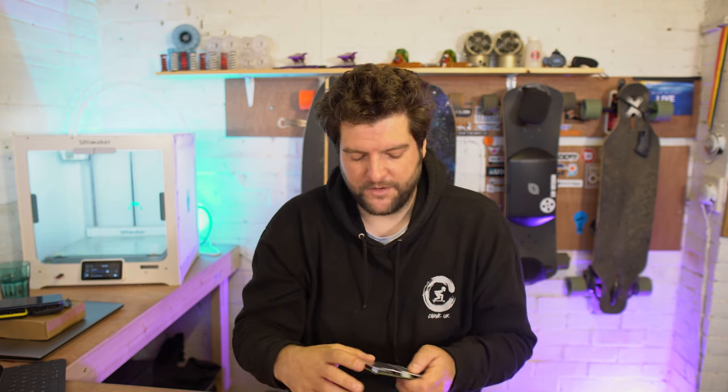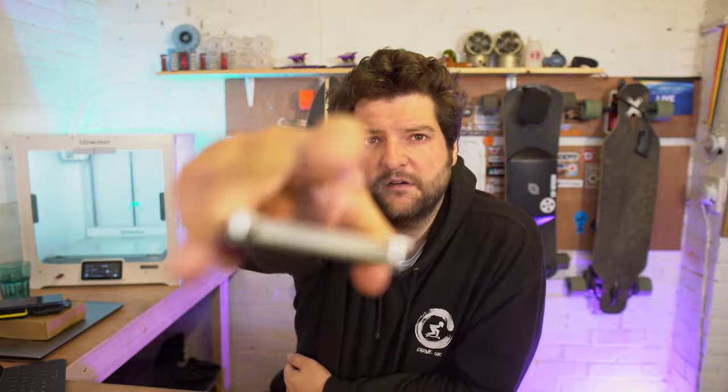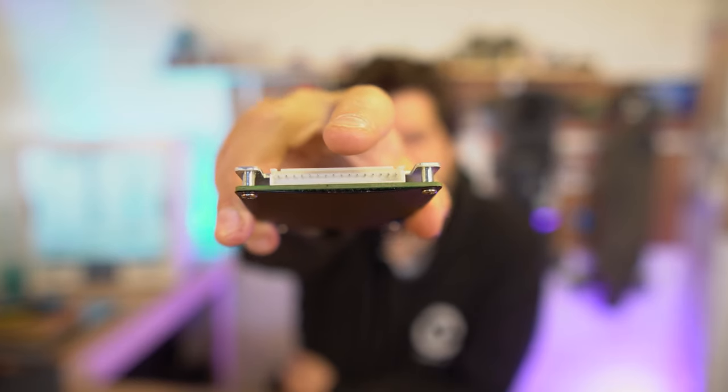So that will be using the BMS in discharge mode. We won't be doing that, we'll be bypassing. So we'll be taking our positive and negative of the battery straight off the battery terminals, therefore completely bypassing the BMS for discharge. But some BMSs have what's called a common charge discharge port. So that P minus, not only is it the discharge port, but it's also the charge port. So if you have a common port, common charge discharge port BMS, then you'd wire the charger minus to P minus. Get what I mean? But we don't, we have the three port version, so we'll just be wiring the B minus and the C minus to the battery.